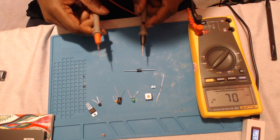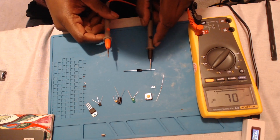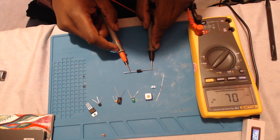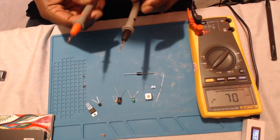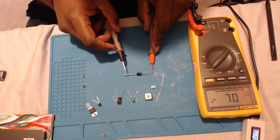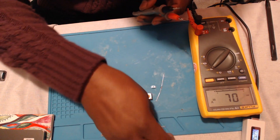Let's go ahead and test our diode. The striped side with the gray stripe is the negative side of the diode, so let's place our black or negative lead on that side and our positive or red probe on the opposite side. We're looking for a reading of between 0.4 to 0.7, and we see on the meter — 0.55. Now let's switch the probes around: the red probe on the negative side of the diode and the black probe on the positive side. We should get an OL reading on the meter, and that's exactly what we got, so this diode is probably good.